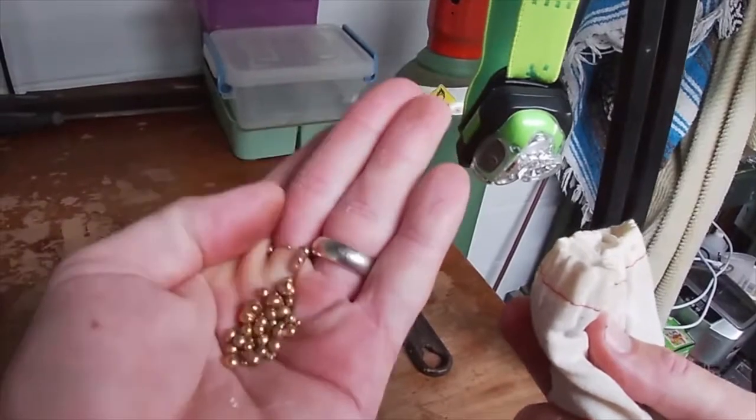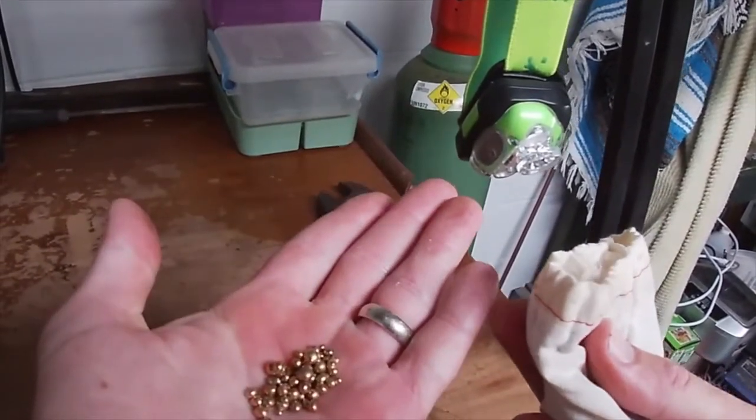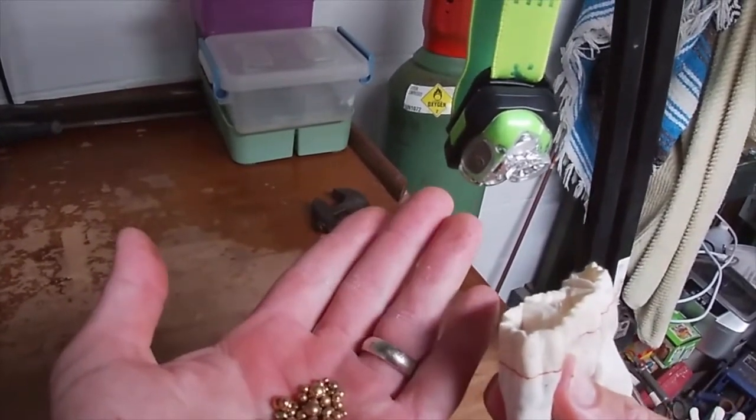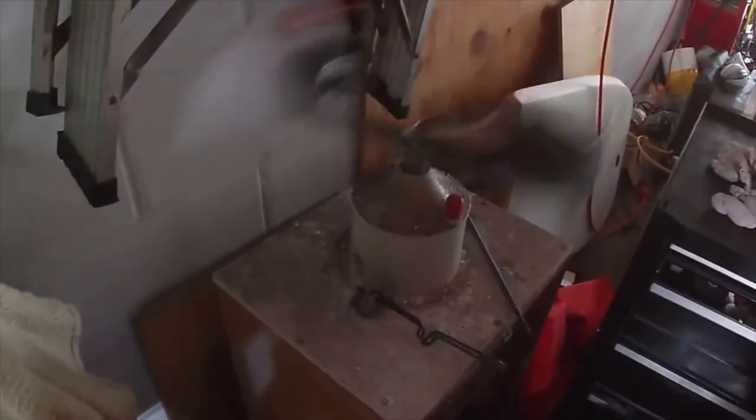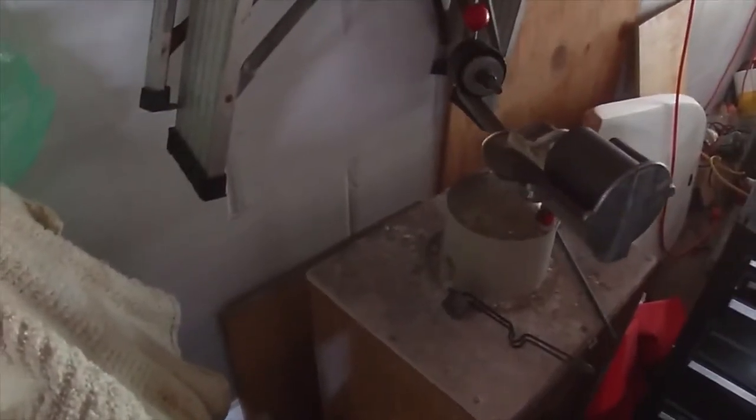This is what they call ancient bronze, but it just means it's actual copper and tin. So I use a propane and oxygen torch. And then when you see it turn into like a ball, you let go, and then you go like that and let it fly. And that pushes all that liquid metal into that void, that space inside the flask, to fill where the model was. It came out pretty well.